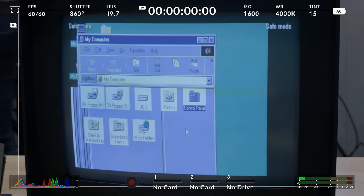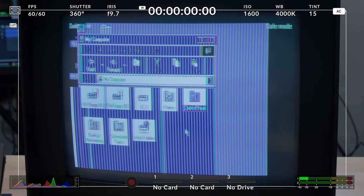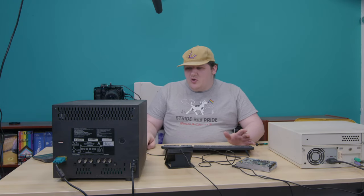And the reason it doesn't look right, I think, is because Windows is not populating the palette registers. It's not updating the palette registers. So it's just using the base EGA 16 colors, and thus they're being emitted in the 4-bit color space. It's my guess. So, yeah. So this is all quite bad.